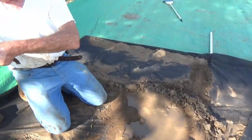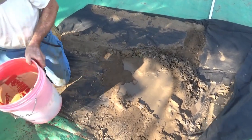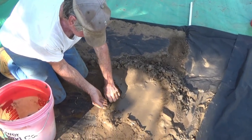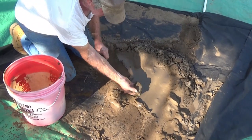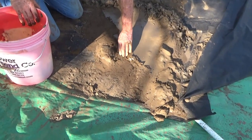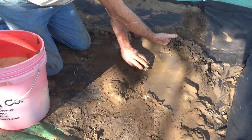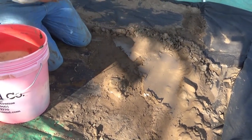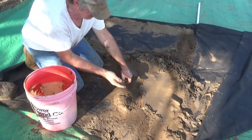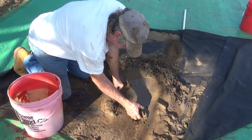We'll deal with it later and go ahead and use this sand bed — this is what we really want on the bottom, because that will allow percolation of the water and solution down to the pipes. That's what we're working on right now.